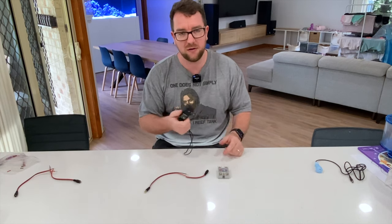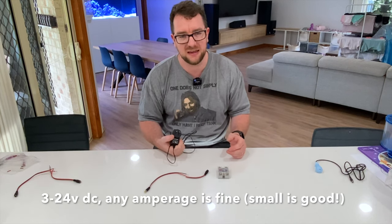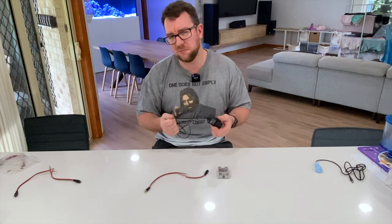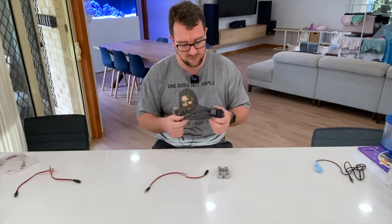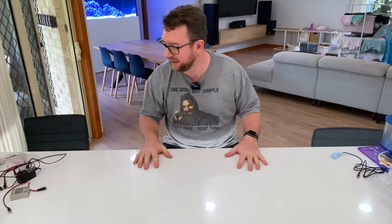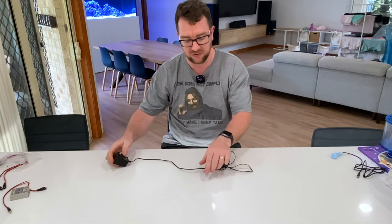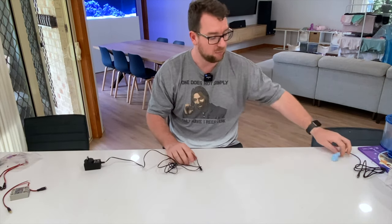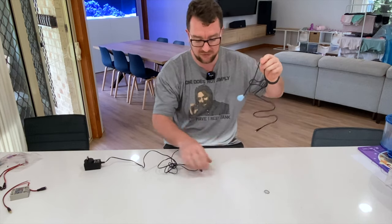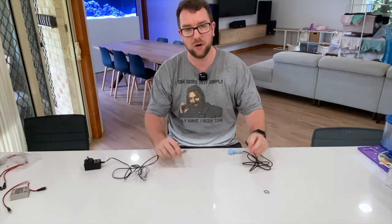Most people have one of these laying around. Just make sure it's a DC output — it needs to be more than 3 volts DC and less than 24 volts DC. The smaller the better; you're not wanting to run a lot of current through this switch. I've just got this little one here from an old modem — that's going to work a treat. So now you know what the skimmer overflow switch is and what components we need. Now you need to know how to build it and how it works. We're going to start off with the power supply — this is going to plug into your mains outlet and give you a small DC voltage out. We want that power to go through the float switch, and you'll see we've got the same size connector coming out of the power supply and from the float switch. In the middle of all that is our relay. The relay has the input on the bottom and the output up the top — when it sees a voltage applied to it, it's going to join those two output contacts together.